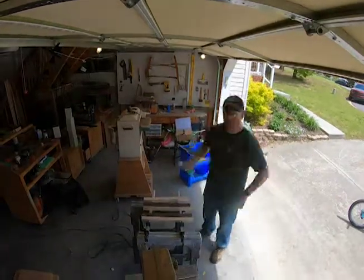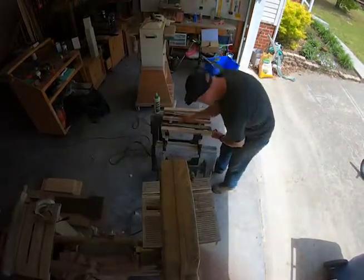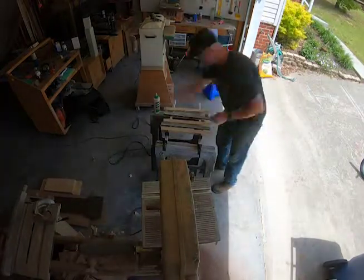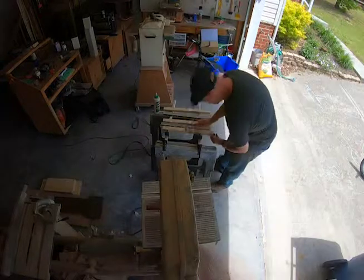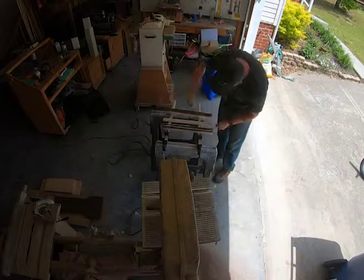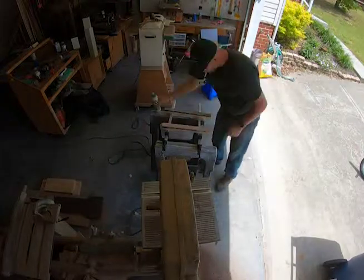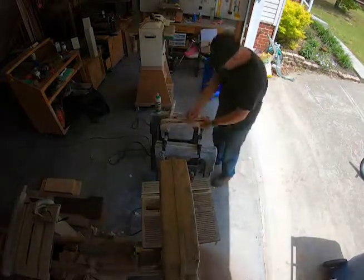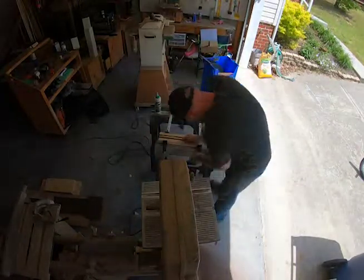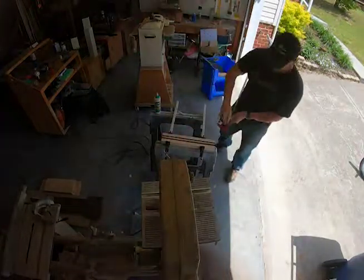And now back to the glue up process. These 24 inch bar clamps that I've got laid down are brand new, used them a couple times. One of them is defective and I took it back to Woodcraft already and they exchanged it. The screw mechanism worked fine until you got it under pressure, but then it bound up real easy, and the screw was chewing itself up inside, and you'd actually get shavings of metal, and still it wouldn't get a tight squeeze. So I took that back and they replaced it.